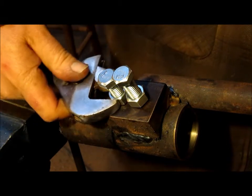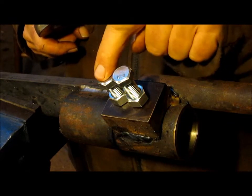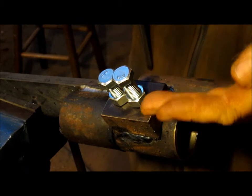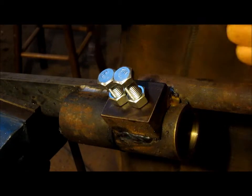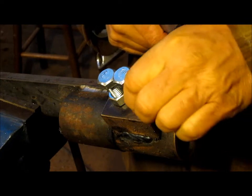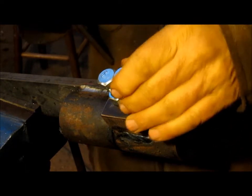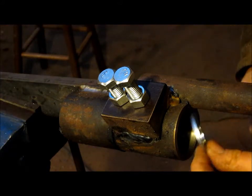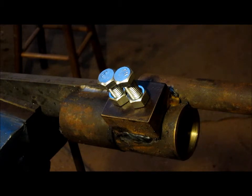Come in, tighten the counter lock nut, and this one is for the 22.5 degrees and 67.5 degrees. Because I couldn't get the dimples to be on the same line, I had to do two bolts. So then I just snug down this one here just to make sure that it stays in place. And then we put a stop washer back here and we get ourselves a nut.